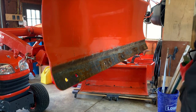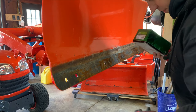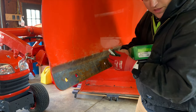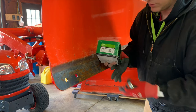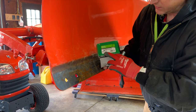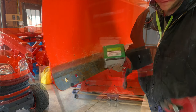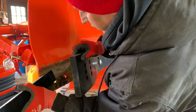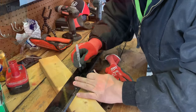The other thing you're gonna need is longer bolts because this rubber's so thick. So these are the ones that come with the plow. These are the ones you need. I bought one of these from Messix, and then I bought this pack of them on Amazon. So I'll put a link to those too, but they're 5/8 by 11. They're 3-inch bolts, and then 5/8 by 11 pitch. So this plastic piece goes in here, and it fills that gap and lets this thing sit nice and flush.